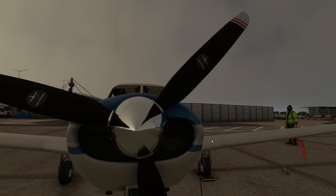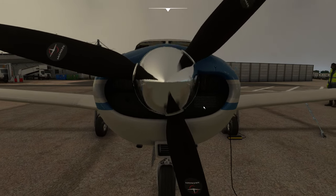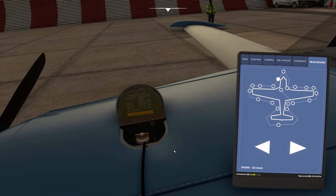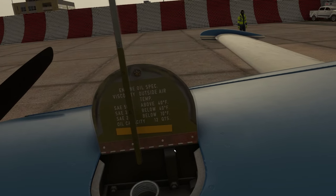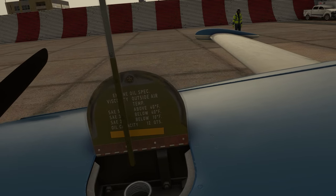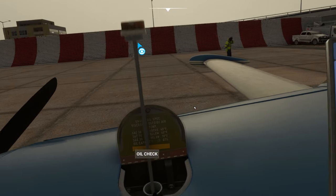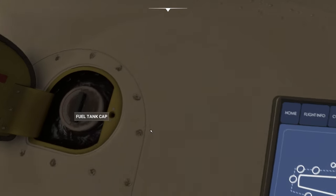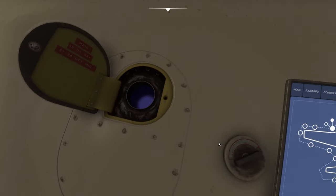Check state of the propeller - it's all good, the intakes are all clear. We've had our engine heater in, quite rightly. Our oil is just under 12 quarts and it's a middle-of-the-road colour as far as I'm aware. Let's put that back. Yep, I'm satisfied with that.